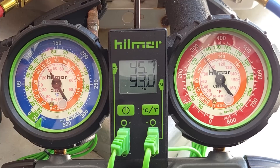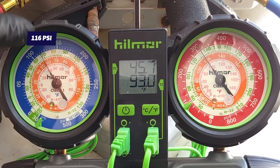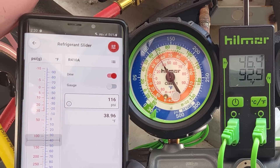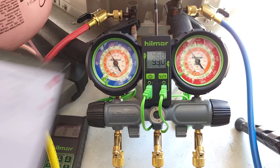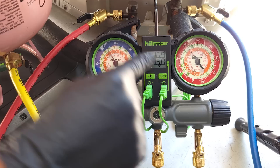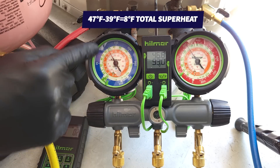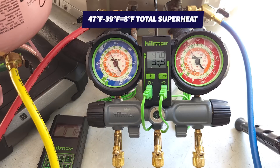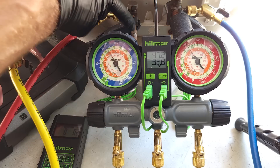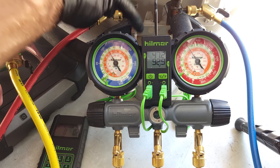Now let's look at the low pressure side — we're measuring a pressure of about 116 PSI. We bring it into the R410A pink saturated temperature inner ring and we're reading about 39 degrees, confirmed by our app at 38.96, so 39 degrees. To figure out our total superheat, we take our line temperature on the large vapor line, which is 46.8 — call it 47 — minus 39, and we're left with 8 degrees of total superheat, which is good. The TXV is able to maintain a superheat of about 8 to 14 degrees. Our TXV is good and we do have a solid column of liquid going to the TXV, but we are definitely low on subcooling, so we want to add some refrigerant.